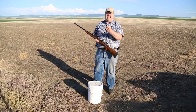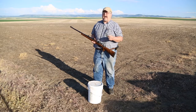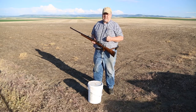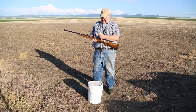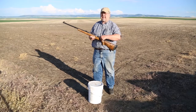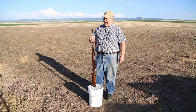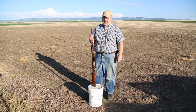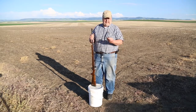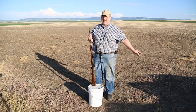Perfectly formed case with the neck about halfway to come off. These cases did their job in the original fire-forming steps, and blowing them out in one step from 8mm to .416 is cutting it kind of close. But this gives a good example of fire-forming brass. The barrel is slightly warm, not even hot. I saved the price of half a dozen dollar bullets, and it's time for these guys to hit the road.